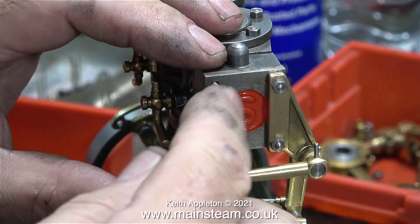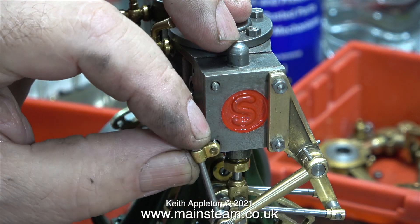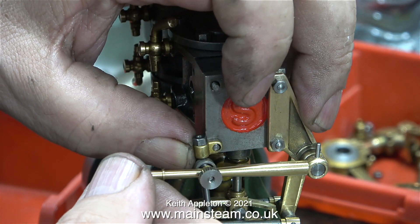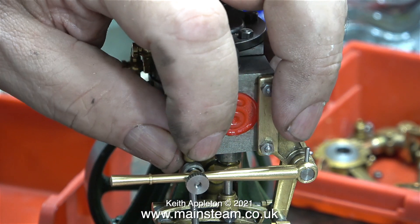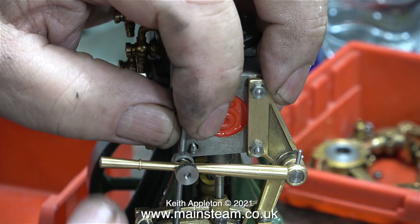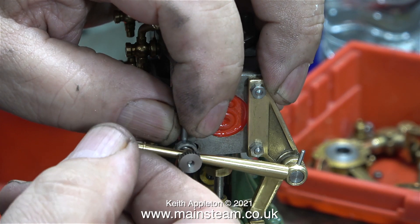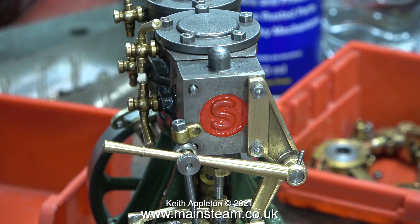As far as I can see there is something quite wrong with the geometry. Stevenson link valve gear uses a system where you can lock the reversing lever onto a bar like this, but unfortunately this mechanism cannot work with this engine. As far as I can tell, the cross drilled hole in the reversing shaft is in the wrong place and the position of the reversing lever relative to the drop arm is not 90 degrees. When I make and assemble valve gear I always connect the reversing lever to the shaft using Loctite 603, and then when everything is in the right place I drill the end of the reversing lever through the shaft and put a taper pin in.